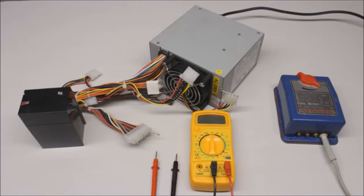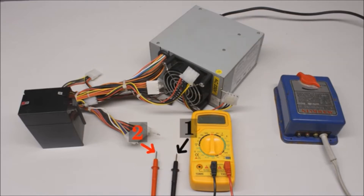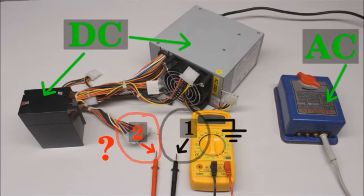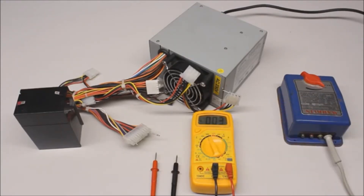The next test series deals with different voltages: a 6V battery, a computer power supply with output voltages of 12, 5 and 3.3V, and finally an adjustable transformer of a model railway. Voltage is always measured between two points in a system. Usually a common reference potential such as the ground of the system is used as one point, and the black test lead is connected to that point. The difference in potential between the reference point and the tip of the red test lead is indicated by the multimeter. When doing voltage measurements, you have to know whether it is DC or AC voltage. The voltage output of the battery and the computer power supply is unidirectional, hence the rotary switch has to be set to that functionality.